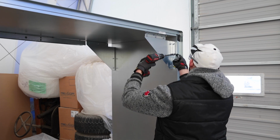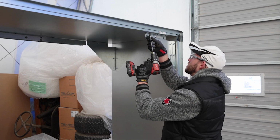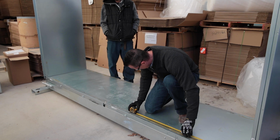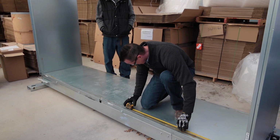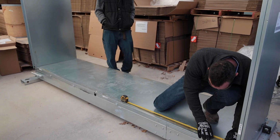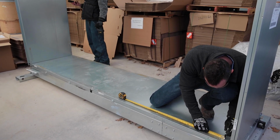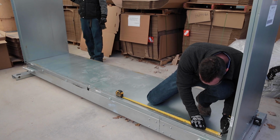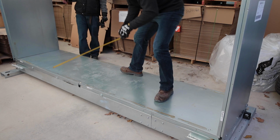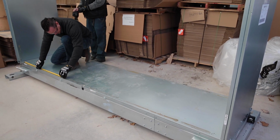All Dynamic V8 modules in a section are the same width and evenly spaced across the section. First, find the center point in the air handler section. If there are an even number of modules in the bottom row, then the first mounting post is positioned in the center of the section. Refer to the submittal drawings for exact mounting post location and spacing. If necessary, cut the posts to the interior height of the air handler.